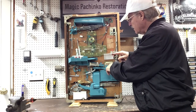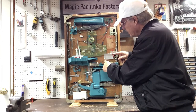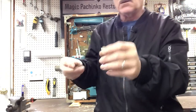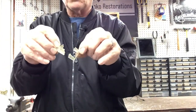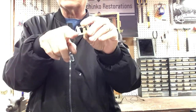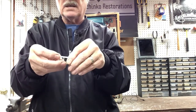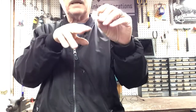The balls rest in here, and then they tip forward and go out. Well, there's a piece right here that's attached to the metal plate that's behind this cover, and it was completely broken into 2 pieces. So these were the pieces of that. Let me get them in front of my jacket here so you can see them. They were broken. These 2 go together, but they're held in place by a couple of rivets that went into the metal. And it's almost impossible to try to get this glued back together and then glued back on and have it work right, because it has to line up and let the balls pass through.